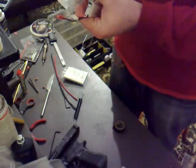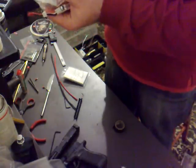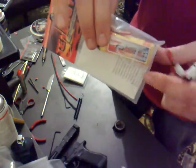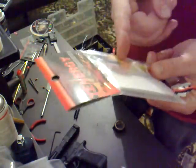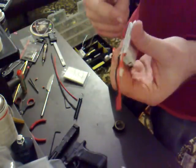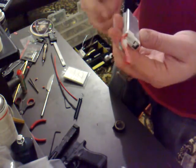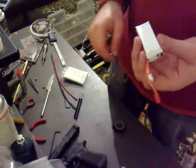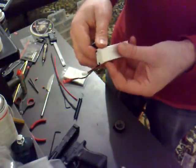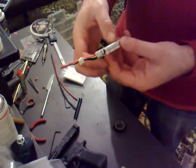The person who sent me these LiPos has already had the outer coating off one of them. The other one still has its plastic outer coating on, so you just basically split that outer wrapping and peel it off. Then you're left with the silver metal casing inside. It takes quite a lot to puncture that, but if you squeeze too hard you can dent it, deform it, and eventually perforate it — and then obviously the LiPo is going to be dead. So just be careful with the metal outer coating.